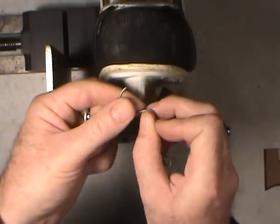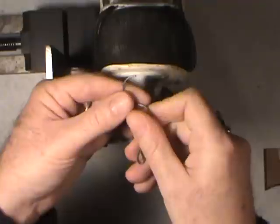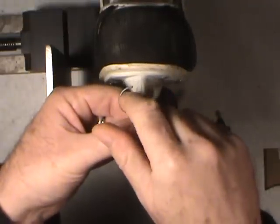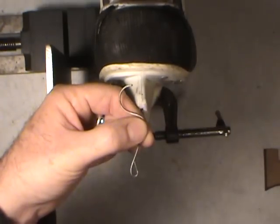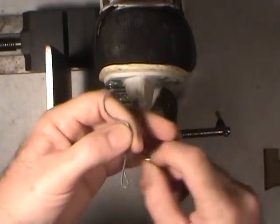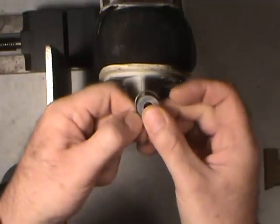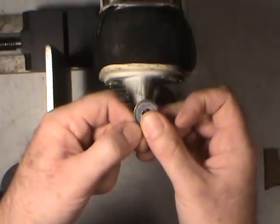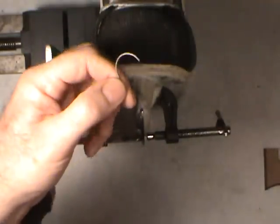And I left this part here long as I pulled with pliers around it. It was a piece of shafting. I used 3/4 inch diameter shafting and pulled it. Once I got the radius to conform to the shafting, I used it similar to this washer here and made sure to shine a light back there and get it as close as I can. This is, like I say, the redneck style, and it works really well for me.